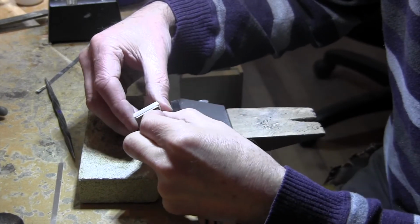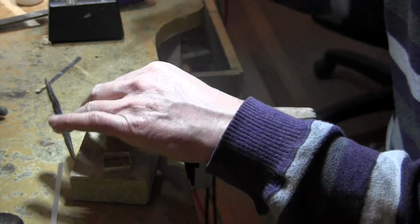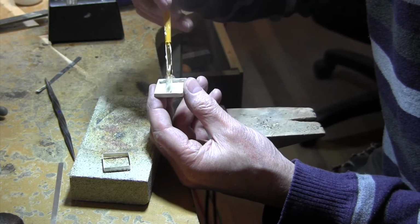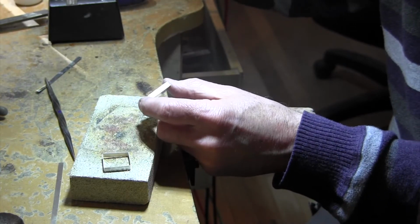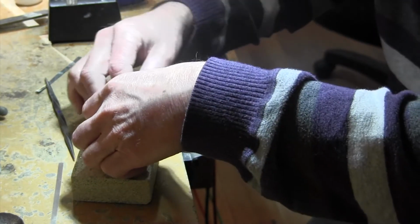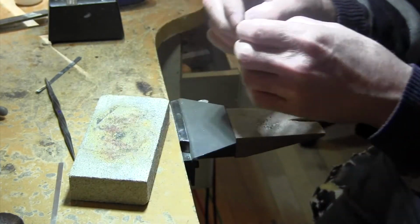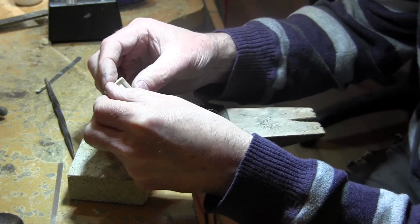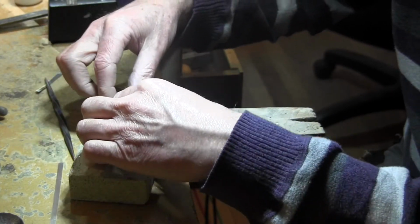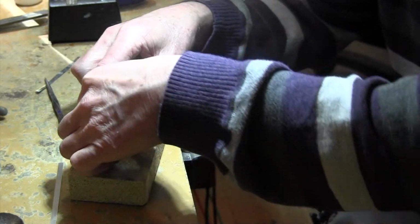Okay, so I've put solder blobs on the bottom of all sides here, and I've checked the fit, and it doesn't seem like I have to sand it, so that's good. So the next step is to flux the sides, the sidewalls of our box top here, and then reinsert it. And that's good. This one wants to spring down away from the wall. Maybe we can take it out and make it not want to do that. All I did was give it so that it would want to push into the wall rather than away.